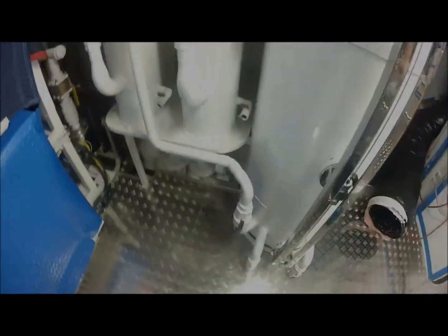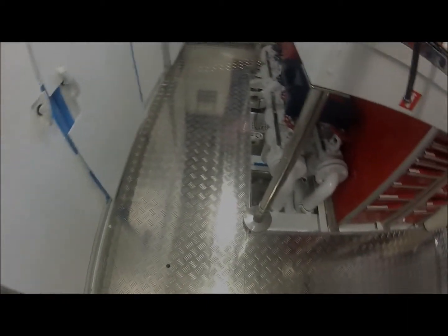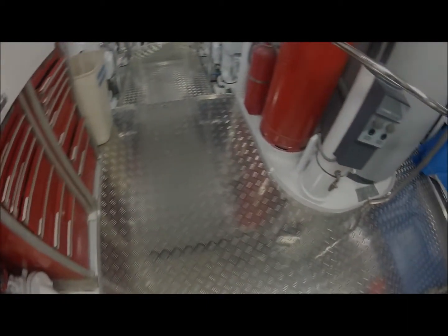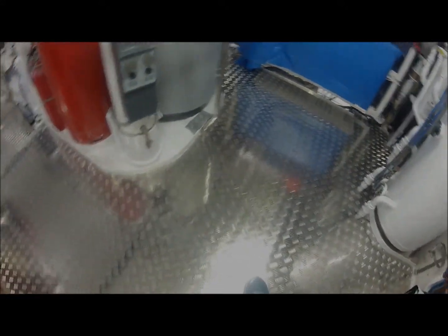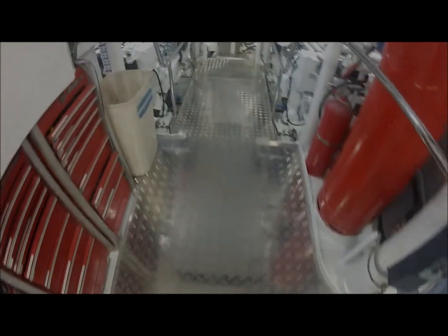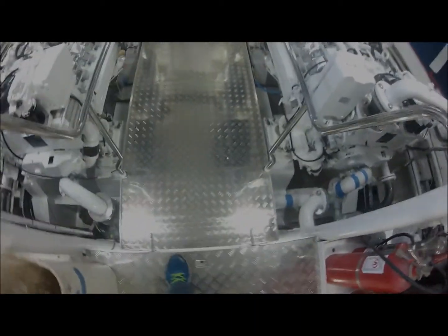Sora engine room deck plates. Three-eighths, five-bar, with a quarter by one inch welded aluminum rim around all the exterior. This is the forward section around the workbench. All plates customized to fit and drilled and tapped to secure into place.